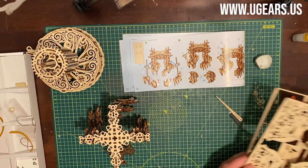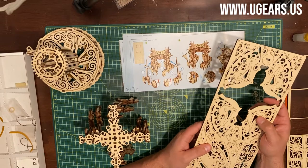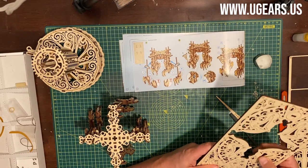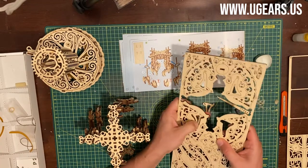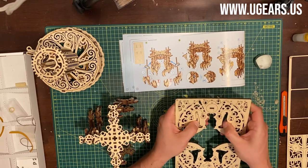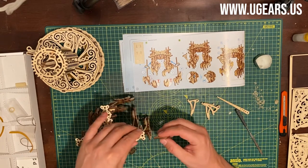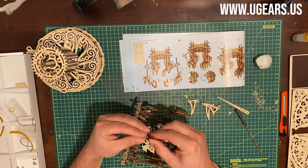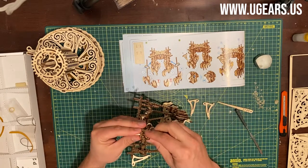I'm putting it in garbage, but I'm not throwing it away yet until I'm done with the assembly. Do not do that, just in case you require spare parts. So we start with the 82, and we need 4 of them. They all 4 are on board number 6. And with the long leg extending down, we're pushing 82 through this little hole, so the triangular piece is towards the top. We do it all around.